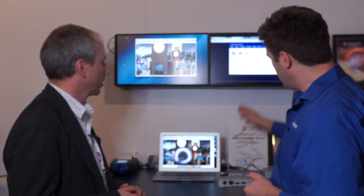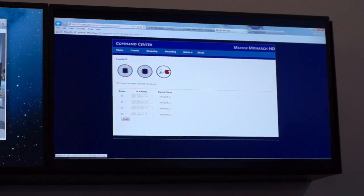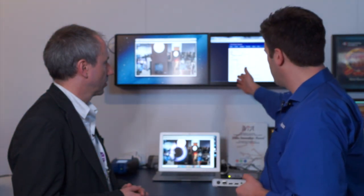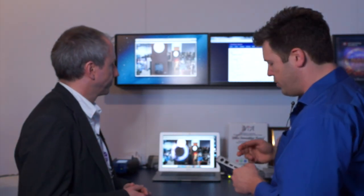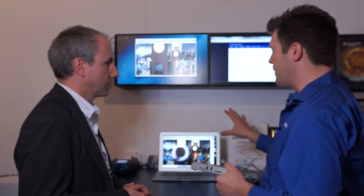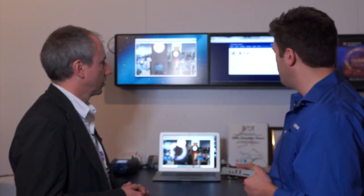We've effectively emulated a mini internet here. To control the device, you just need a simple web page — put the IP address of the device into a browser and you can set your streaming parameters, the target for that stream, and your recording parameters including the target, whether it be USB drives or SD cards. You're setting the bit rates completely independently. Then you're off — you can stream, record, or both simultaneously with one punch.